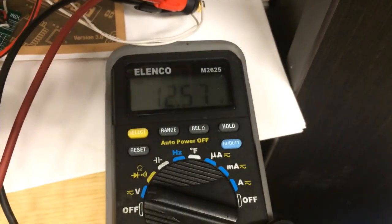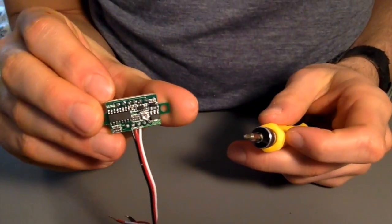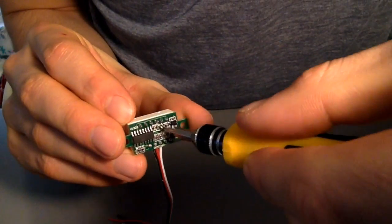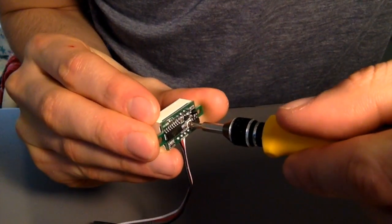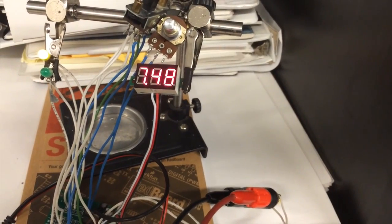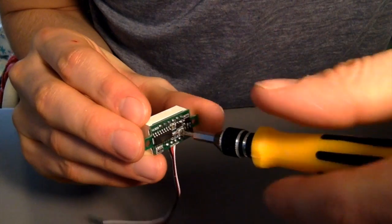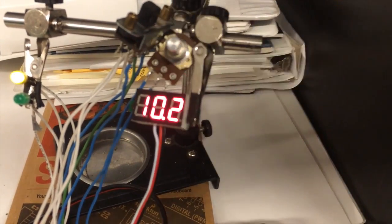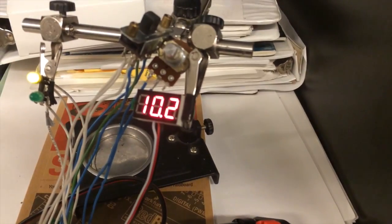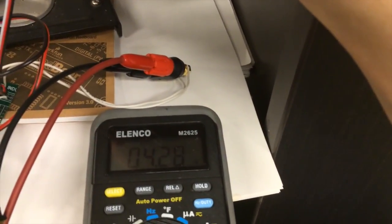When we check the actual voltage on the multimeter, we see that the monitor is a little bit inaccurate. But luckily, we can just calibrate the monitor with a screwdriver. We can see that the monitor is accurate at least to one decimal place. But when we go down to a smaller voltage, we lose some accuracy. There seems to be a tradeoff inherent to this monitor, but I'm going to opt to have higher precision on the lower voltages.